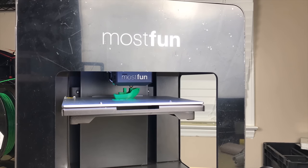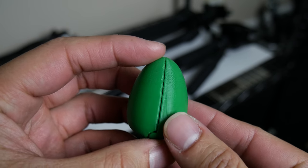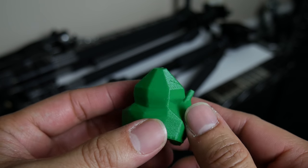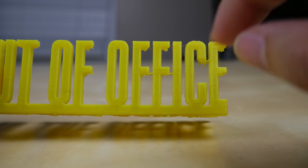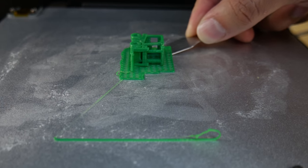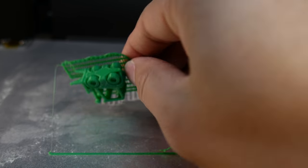So now as far as the printing quality, here are some samples I can show you from playing with it. You can see for the most part it produced some nice prints, but sometimes there are rough edges which you have to clean. On a few occasions I saw some missed print lines. This is using the standard filament, and based on my research and my friends telling me, buying a better quality filament makes a huge difference. They included a glue stick which you can apply to the bottom of the bed, which I found worked extremely well, and I never had any issues with the model falling off the plate during printing.